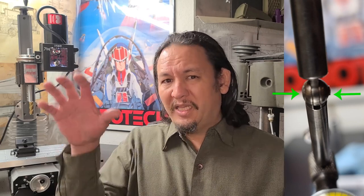I also found I had much better control rotating the end mill holder up at the pulley. Another shortcoming I found was related to the double-jointed armature I use for my indicator — some of those joints were worn out and slipping, giving erratic readings and inconsistencies. To fix it, one approach I chose not to use was pinching it together, as that has never really worked for me and I tended to break ears off whatever I was working on. Instead, since I have lots of shim stock, I cut a small washer or disc of thin shim stock — starting with one thousandth — which I found was more than enough to tighten it up.